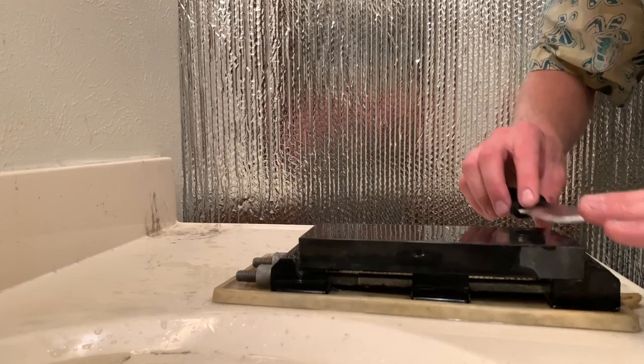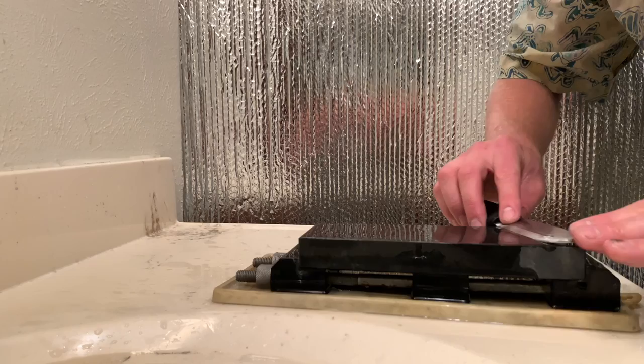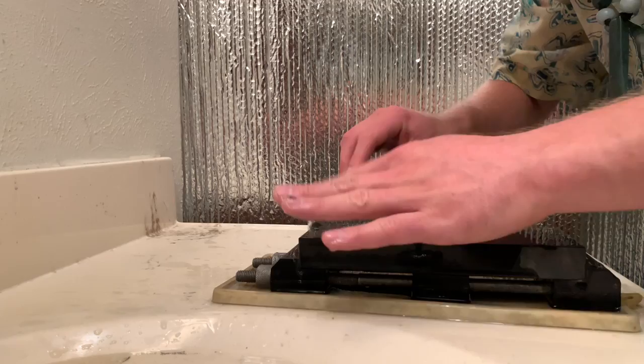I think it's important to just do one stroke on each side at a time after you get your basic bevel set. Sometimes I do a lot more strokes near a problem area of the edge, like the tip, for example, where I was fixing that chip. And then at the end, I try to get everything planed in nice and smooth. One stroke across the whole edge.